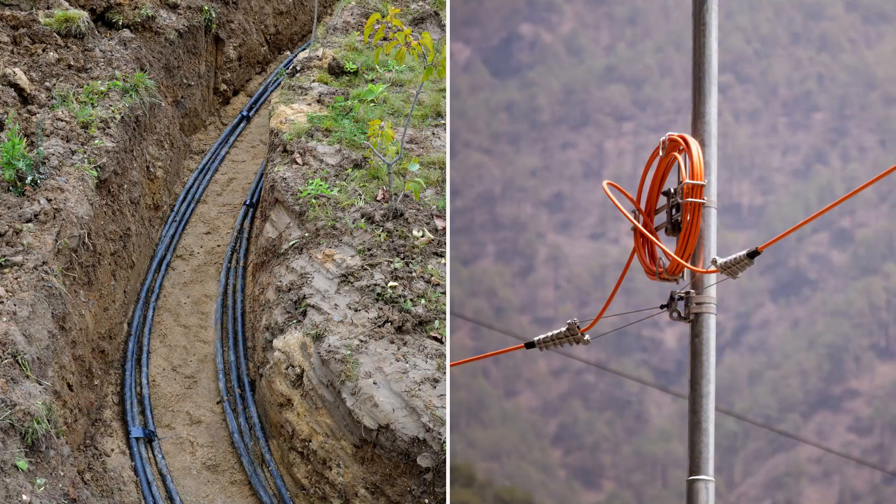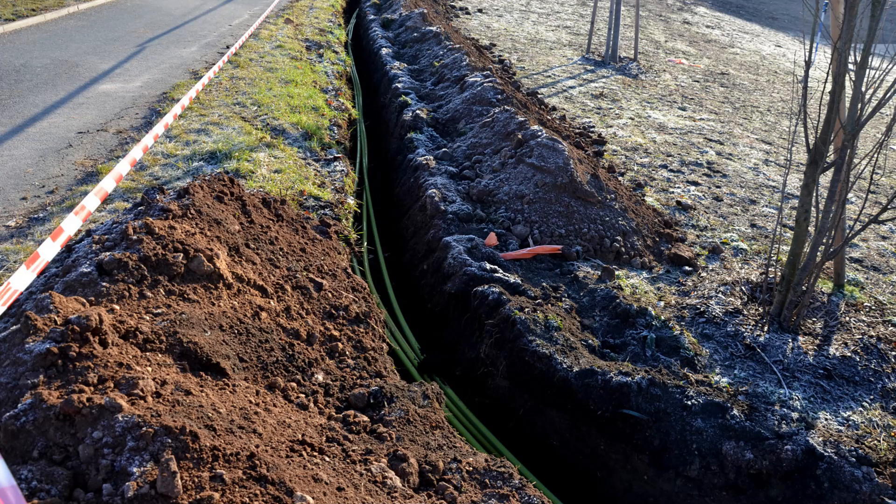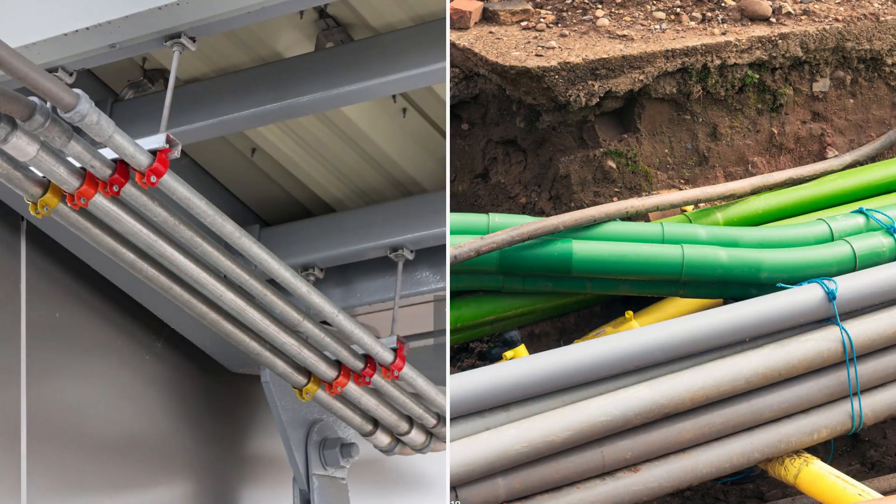There are mainly two types of fiber optic installation: you can directly bury them under the ground, or you can pull the cable through a conduit. That brings us to our two types of fiber optic cable — the direct burial fiber optic cable, and the indoor-outdoor type. Direct burial cables are rugged; they can be buried directly without a conduit, thanks to their protective layers, armor jacket, and water-blocking components. Indoor-outdoor cables are versatile and easier to handle, but they require a conduit for outdoor installation, protecting them from environmental factors. Choosing which one depends on your installation environment.